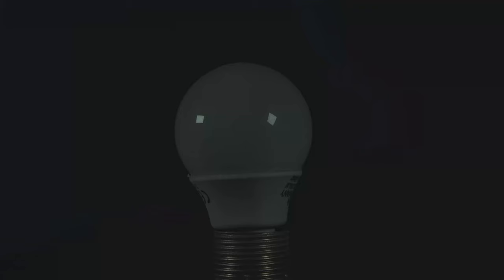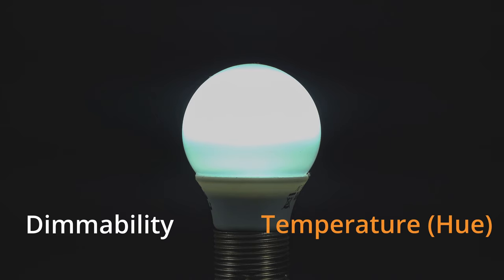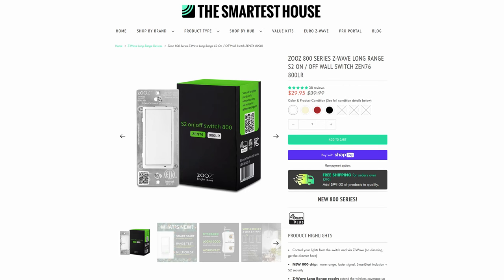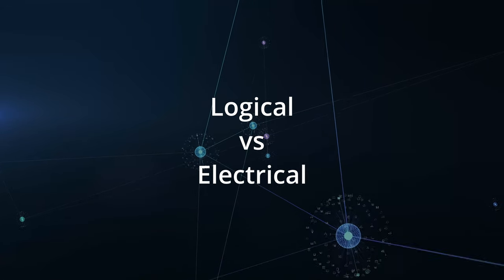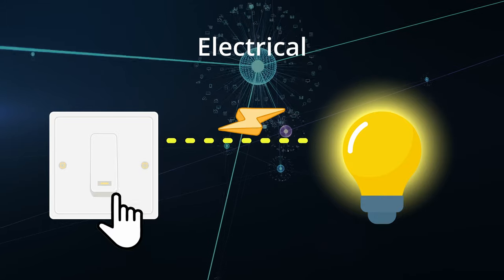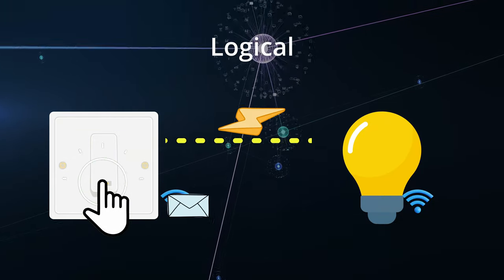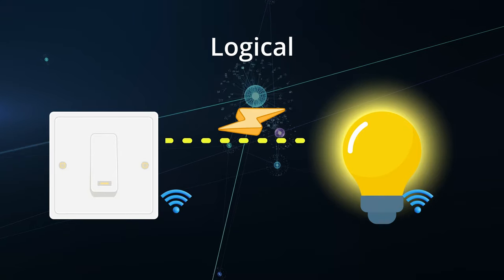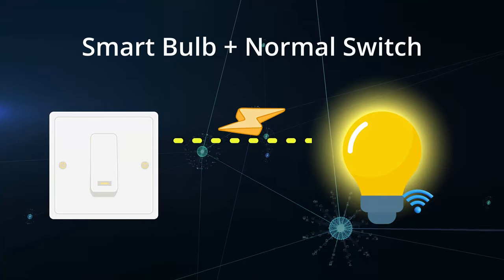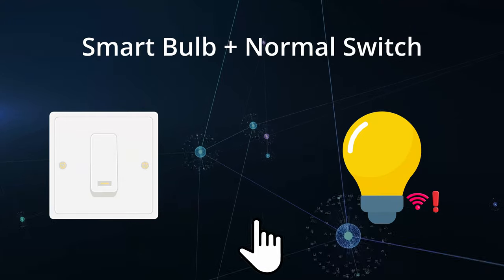So how do we do this? In the example of the smart bulb — do you need functions unique to a smart bulb, like dimmability, color temperature, or hue control? If not, a smart switch may be a better option. If you do want those controls, the answer may be to pair a smart bulb with a smart switch. Let's talk about the difference between logical and electrical controls. Electrical control is when a device is controlled by disconnecting electrical power via a physical disconnect like a light switch. Logical control is when the device receives a signal from another device — like your smart home or smartphone — telling it to power off, while a small amount of power keeps the logic circuit online.